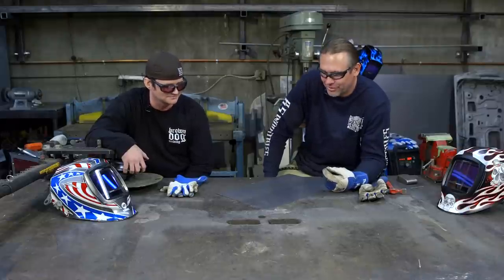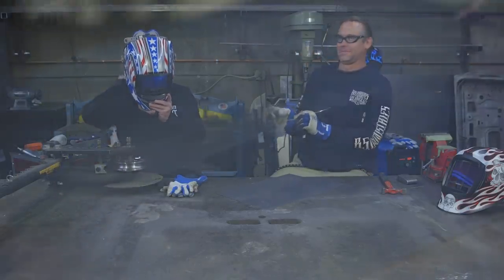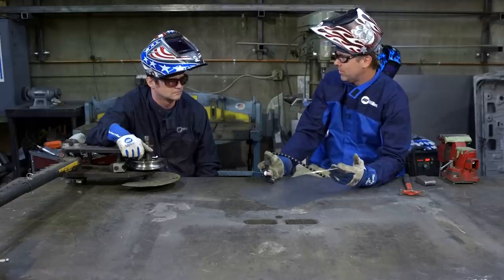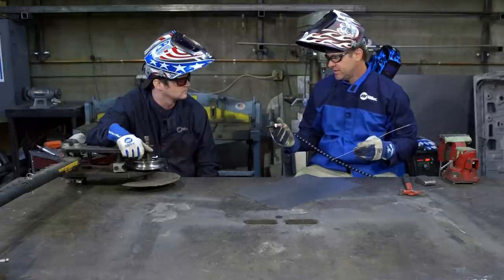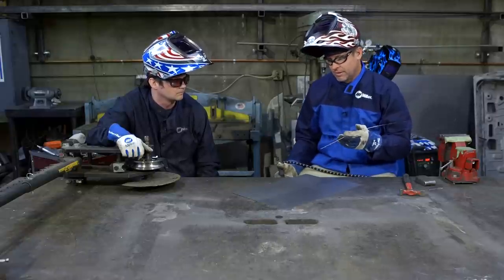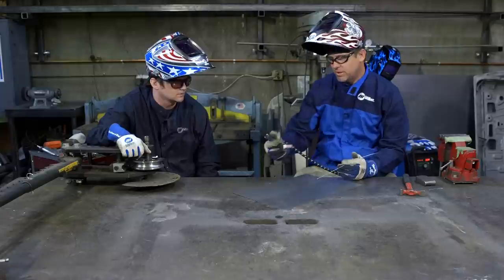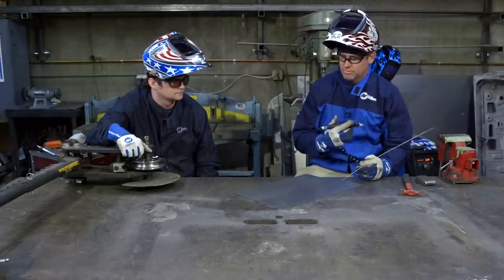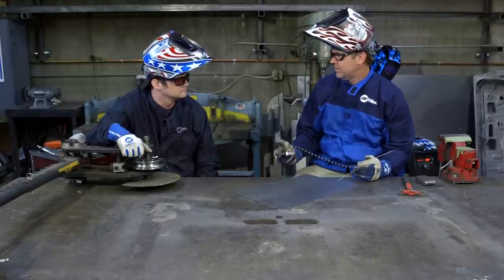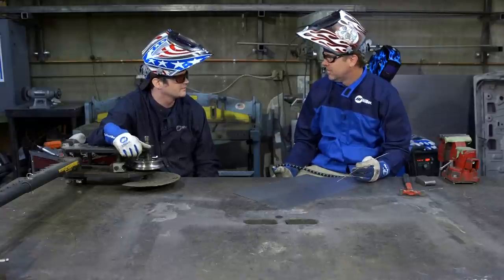I'm interested in it because I've got my 1970 Buick Electra project with rust repair on the fenders and some design features I want to add, and I haven't done much sheet metal welding. What I'm using here is some 20 gauge sheet metal — same as a door skin or quarter panel. I use a 1/16" tungsten and an .045 filler rod, and I set the machine at whatever amp matches the sheet metal thickness — so for .035 sheet metal, I'll set it at 35 amps.